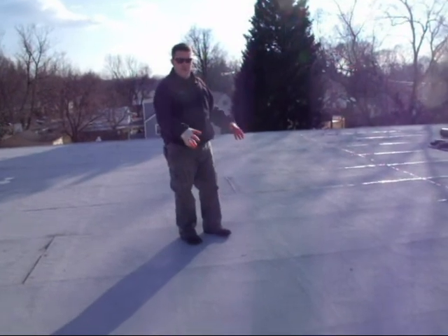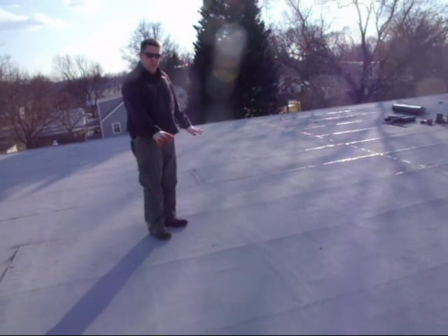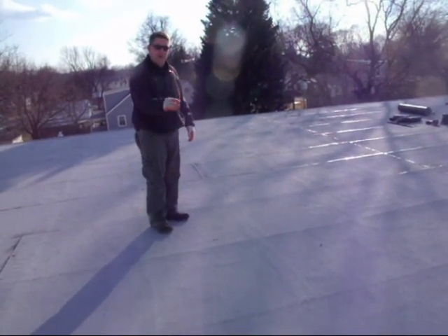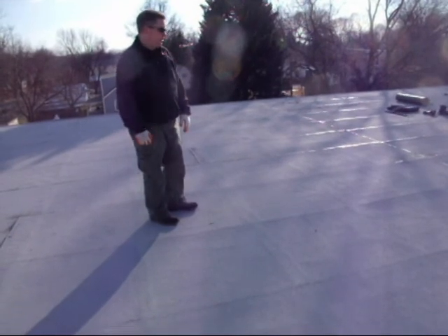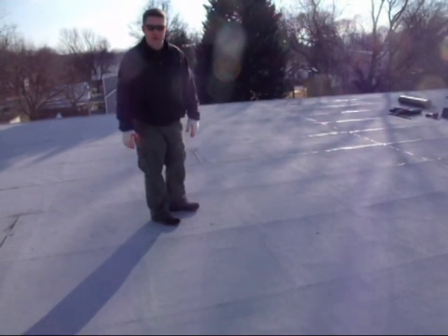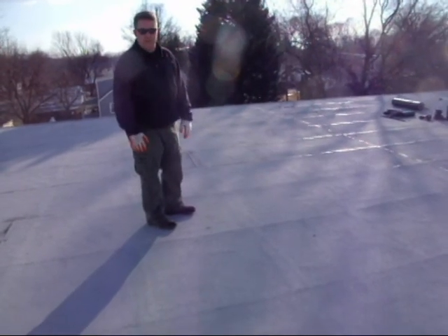When we have the final roof surface on, we're just finishing up with some flashing now. We have the APP 180, which is a modified bitumen with a ceramic granular surface. That's on top of the smooth layer you saw earlier, and it's run across the grain of the previous layer — so that gives you two layers of water protection on this roof.